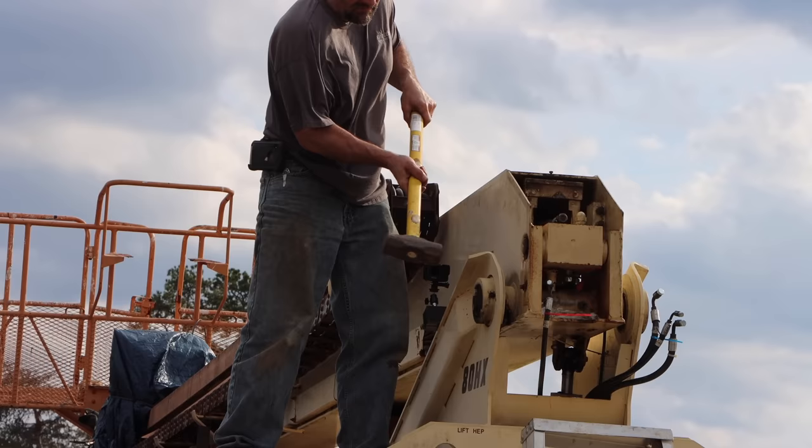Alright, I'm happy with how I have it held, so I start pulling it carefully away from the base boom. The chains are still going through the base boom, so I have to be careful. You don't want to put a lot of sideways pressure on the chains and ruin them. So I get it to a good height, and now I need to deal with the chains. This perspective makes it look like it's sitting at an angle, but it's not. It's horizontal.